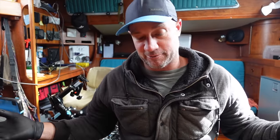I've got three new seals. Our gearbox isn't leaking oil, it's fine, but I'm gonna just replace the seals while I've got the engine and get all the gearbox out. I've already done all the dripless side of it, so we should have a fair chunk of an area that can cause you problems while you're cruising contained for a while. They always arise, but we'll minimize it as best as we can.